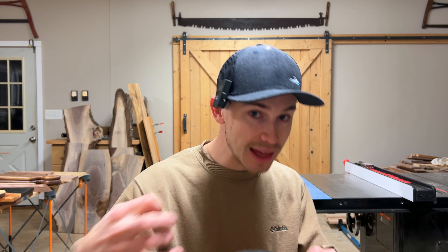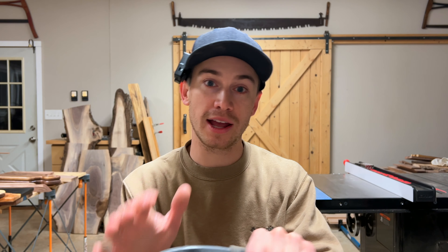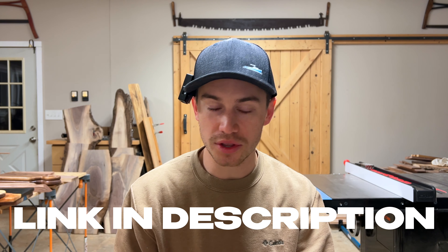Number five, the most important tool in this video, is a $10 million stick — or million dollar stick, depending on where you look. If you have a miter saw in your woodworking shop, you have to have one of these. Basically it's a little stick that keeps your hand away from the miter saw blade while putting pressure on a smaller workpiece you're cutting. Back when I first started woodworking before I had one of these, there were several instances where I was cutting something five inches or less in length on a miter saw thinking it would be okay. Honestly, it is a miracle and a huge blessing that I did not cut off one or multiple fingers, because doing that is so incredibly dangerous.